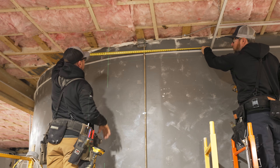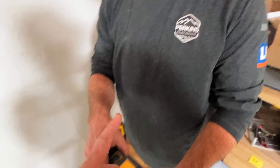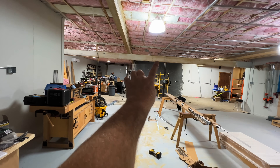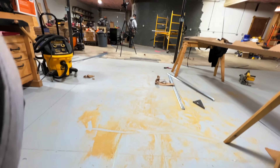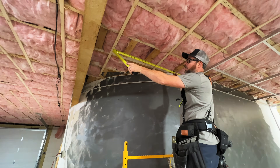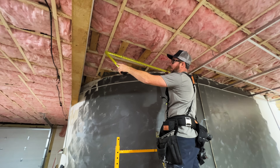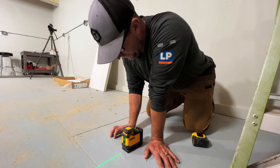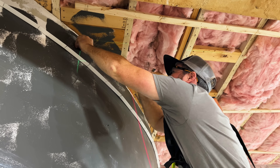The next row of main beam landed on the curved section of the wall. We used another line laser to figure out where that main beam needed to intersect the wall — shooting a line down to the curved wall to mark our four-foot increments. You can't just measure around a curved wall four feet from the track because the angle skews and doesn't give you a true read. We put a screw in the wall to pull a string line back so we could confirm we were four feet off the other track.